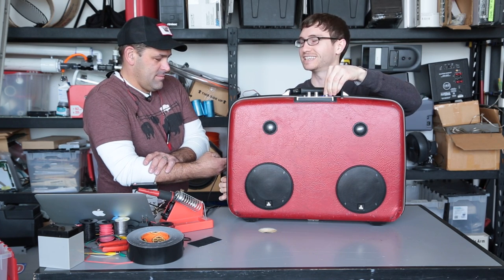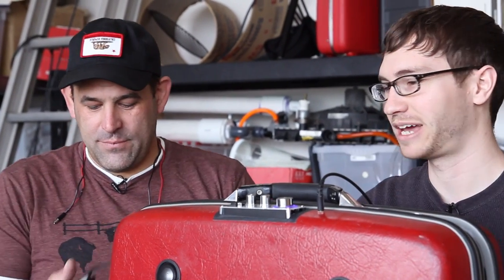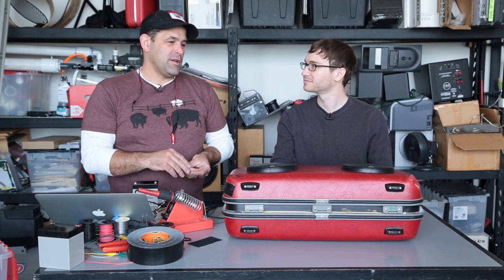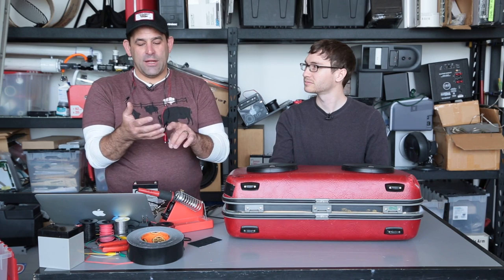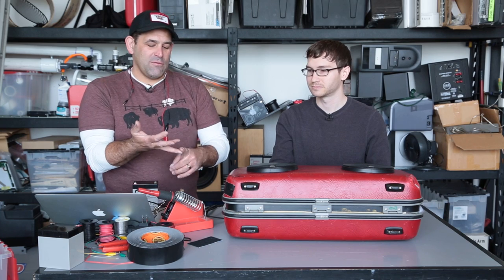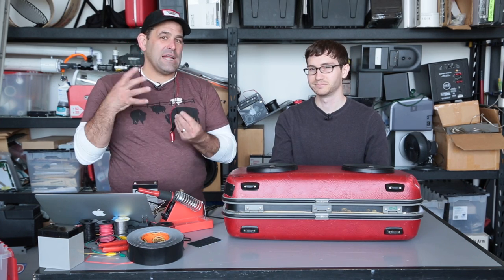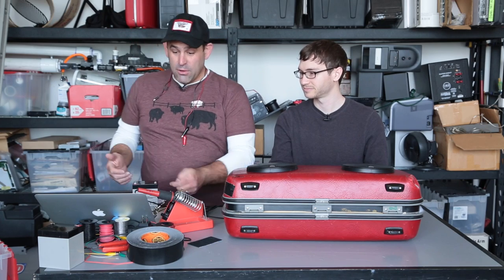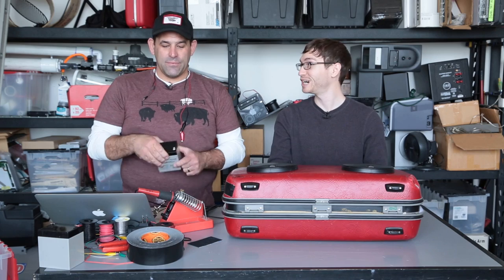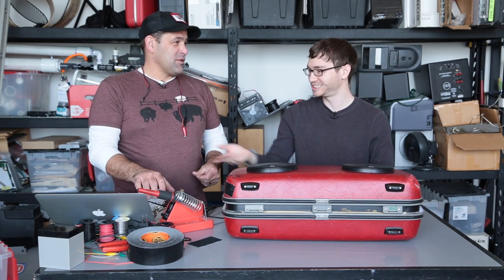So hopefully that answers Jesse's question. Going lithium ion definitely simplifies everything, because it's a complete charging device. If we had raw-wired lithium ion batteries in here, it would be a problem — because the lithium ion battery pack we used is an intelligent battery. It shuts off if there's too much heat, shuts off if there's too much power, and manages voltage regulation. You can't just plug a 2-amp power supply into a raw battery and charge it — it doesn't work so well. That's why I was afraid of them. But there's nothing to be afraid of — you just need to do it right.